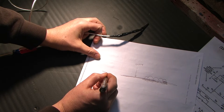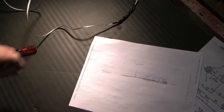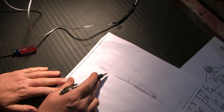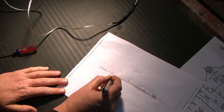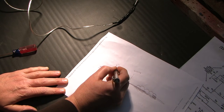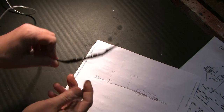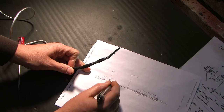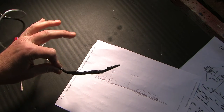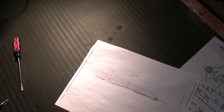The other end is the end with the alligator clip. Between the alligator clip and the wire, you've got to have a resistor. You solder the resistor — one end to the alligator clip, the other end to the wire — and again wrap it all up in electrical tape or shrink wrap if you want something well insulated. That's pretty much it. Now the key here is choosing the correct resistor.